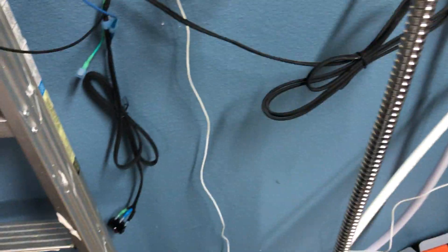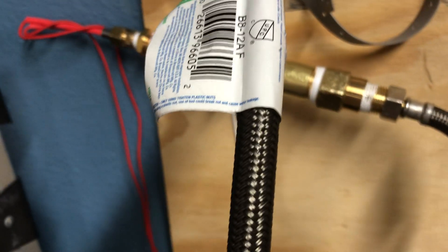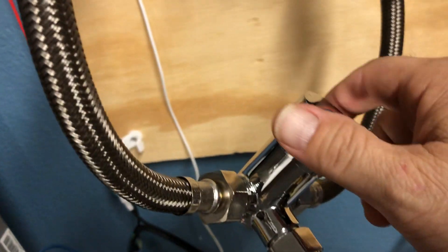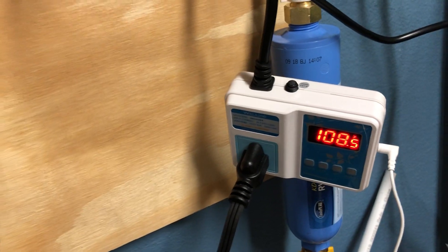However, you might want to restart the water again, and you don't want to get hit with that super hot water coming down. So I set this thermostatic mixing valve to control that. And of course, that's a thermal start coming down now that we're getting water flow again.